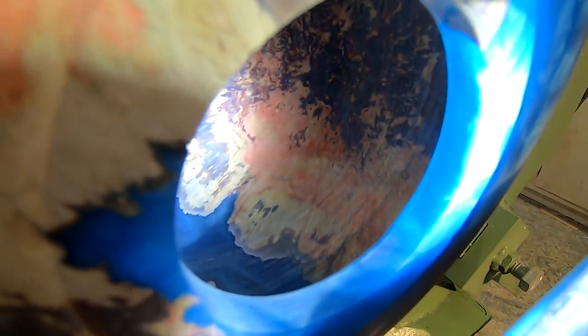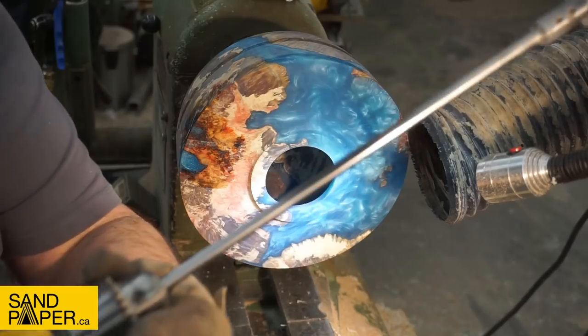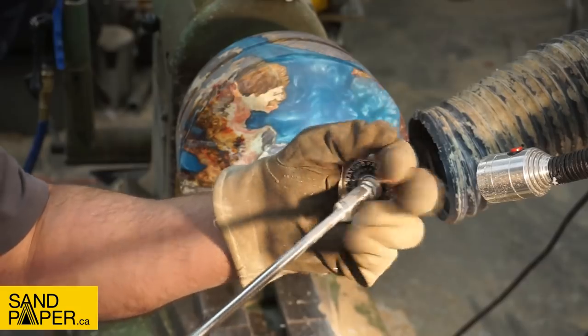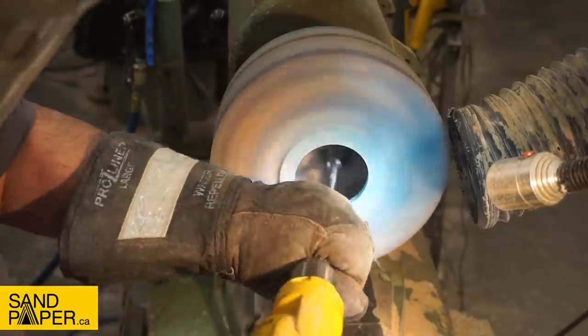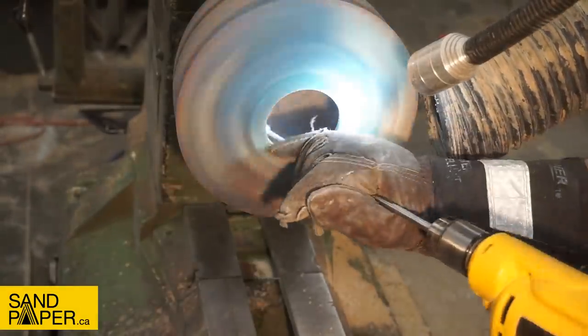We're down to about almost a half-inch wall thickness and I'm going to leave it at that. You'll notice some chip-out over here - no matter what I do it keeps happening and it's getting thinner and thinner, so we're just going to have to sand it out. For sanding inside I've got a little extender with a two-inch sanding pad trimmed down to about an inch and a half, and a three and a half inch disc will just wrap around it nicely to clean up the base. You can come quite a ways up the sidewall as well - it does a pretty good job cleaning up most of the urn.